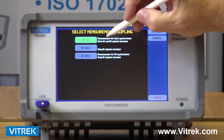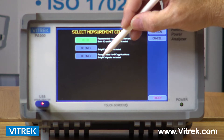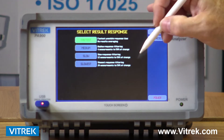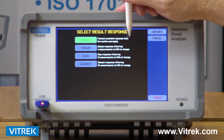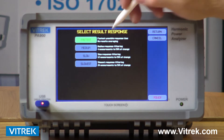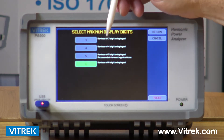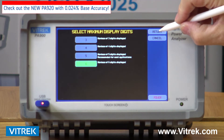My data — I can decide if I want to look at AC and DC data simultaneously, AC data only, or DC data. My response time is how fast the unit is actually sampling and presenting the data. In most cases, the faster you sample, the accuracy suffers just a little bit. The slowest reading is going to give you your most accurate readings. We even have the number of digits presented as a complete reading, which I'll show on one of the screens in just a minute.